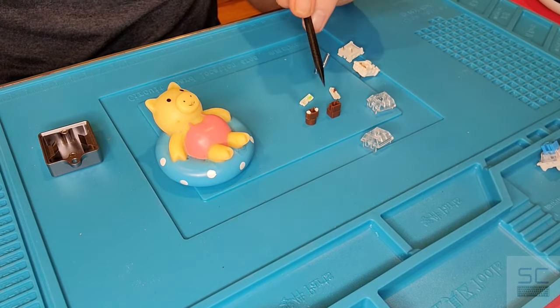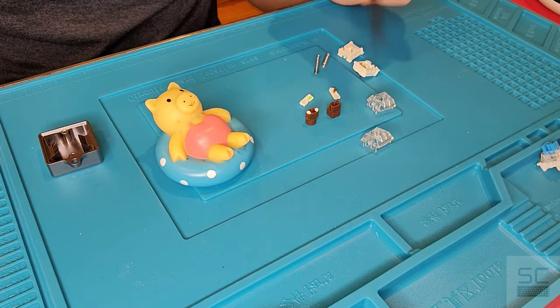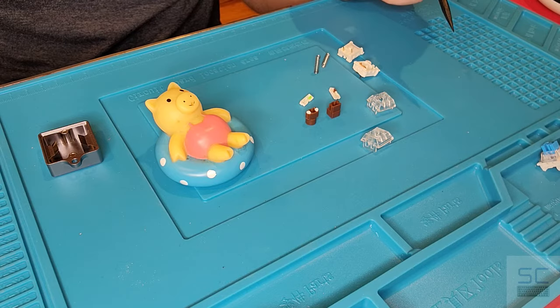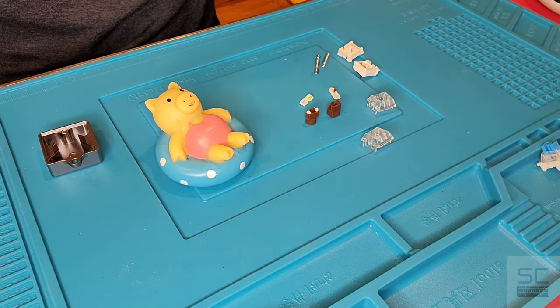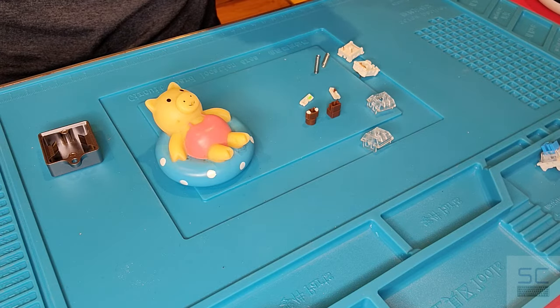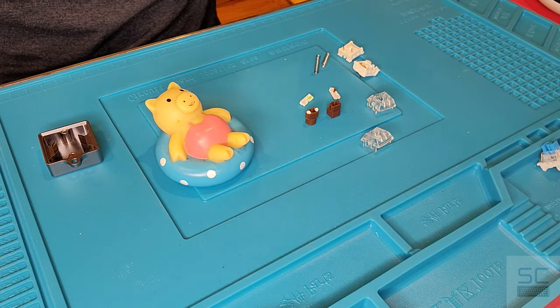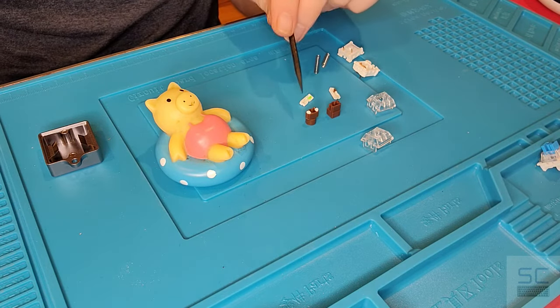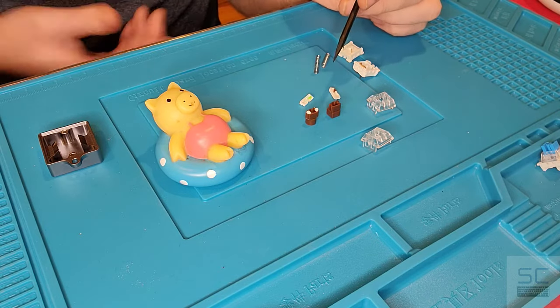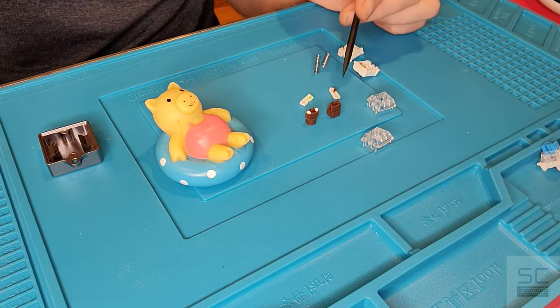What really makes or breaks a quiet switch versus a loud one is dampening. Traditionally you'll see on something like Cherry Silence or Gateron Silence, there are dampeners that really will change the travel distance of the switch, and they'll significantly change the feel of the switch by making it shorter, and it's not the best experience.